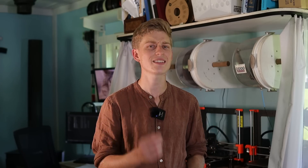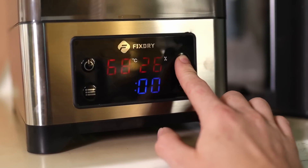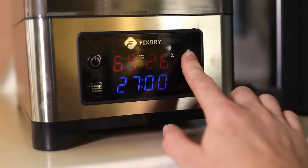A big issue is that most filament dryers and most food dehydrators all top out around 160°F or around 60-65°C, which is unfortunate because in my experience that is simply not hot enough to get good results when trying to dry nylons and other moisture-sensitive filaments. So getting a food dehydrator and modifying it to a higher temperature is a legitimate option. There are also toaster ovens and other electric devices you can get that go hotter, and I would like to see filament dryer manufacturers increasing their maximum temperatures.